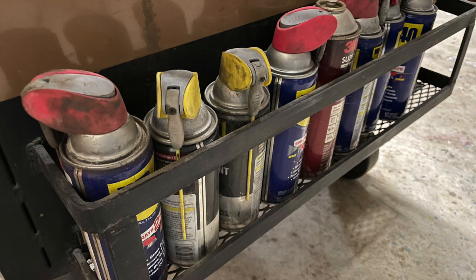The next thing I did was add a lower shelf. Basically we used one-inch flat bar, bent it out — two matching ones, one high, one low. Then I put an expanded metal bottom on it to house stuff like WD-40s or spray paint cans on the job. Having that expanded metal bottom keeps the shelf from building up with dust and debris that you're always going to encounter on a job site.